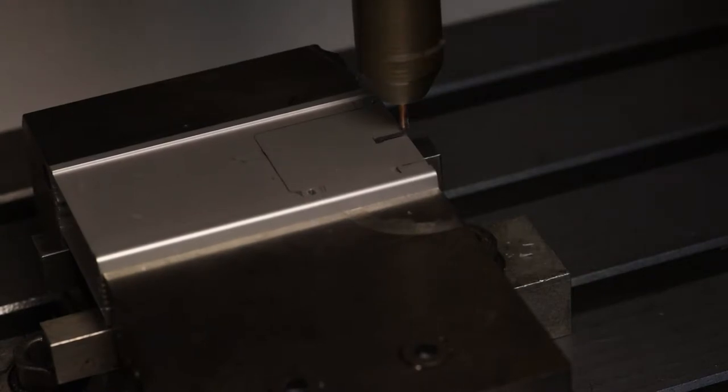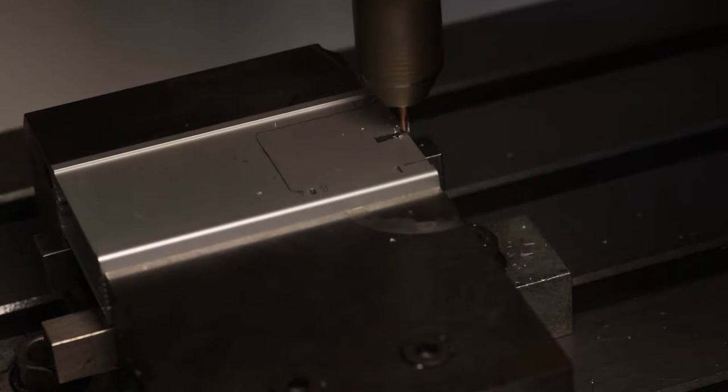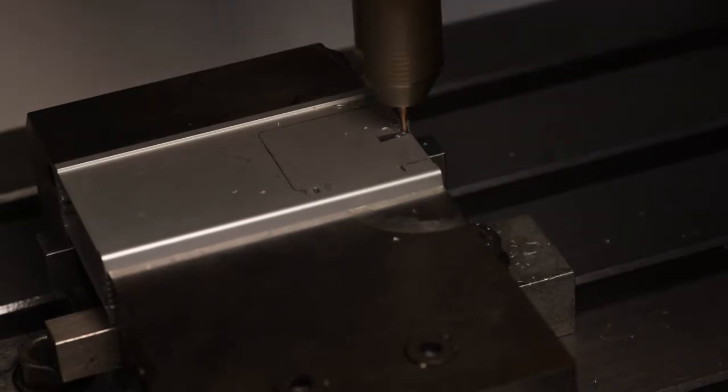As you can see, we are now drilling with a different head. This is simply because, unlike the holes, this slit is drilled from one side, and this means that the drill head will not connect with the body on all sides while it is drilling. This means that we need a drill head with higher stability, and we might also want to add some oil to ease the friction, which we'll do at a later point for similar operations.